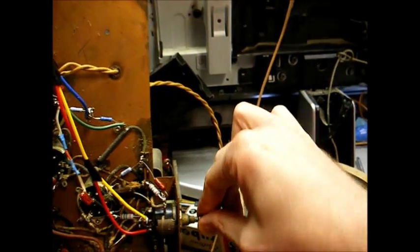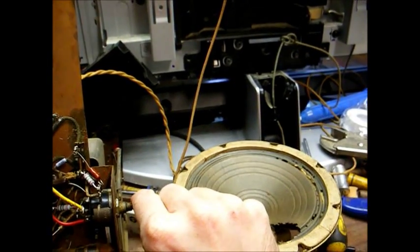We have this radio connected to about 20 feet of wire running out of my shop window, and I'm in Mississippi, and we're just barely picking up WWL 870 out of New Orleans. So that's not bad for 2:30 in the afternoon. This resistor here, R6, is in the plate circuit of the first audio tube. It's a 1 meg resistor, but the original resistor had increased to over 6 megaohms, which would starve the first audio tube of plate voltage, meaning poor performance. Putting the right value resistor in there really helps things — the volume is louder and the audio is not as distorted.